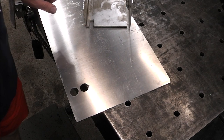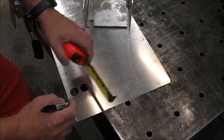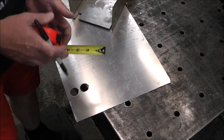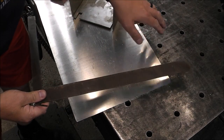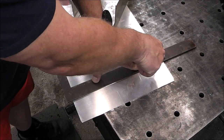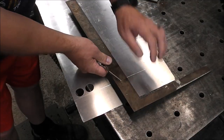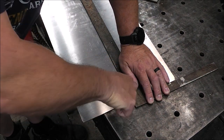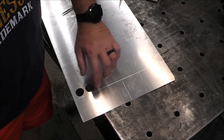I need to make this six by two and three quarters tall, so we're just going to miss this little defect right here. We'll make a mark at two and three quarters. We'll try to maximize as much material as we can — and miraculously enough, this measures 12 inches wide. So all we've got to do is kind of split it down the center. I'm going to put a straight edge on it and scribe it. And now we'll make a mark at six. Then we'll have to create a little lip for the backside to hook over the toolbox.